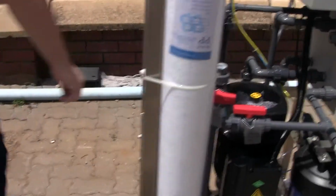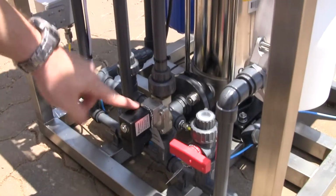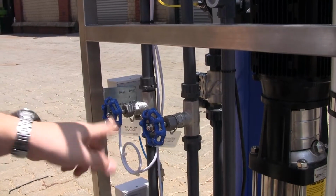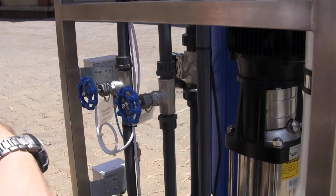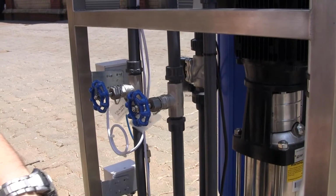And then on the other side we've got the wastewater side. So you'd open this valve, you'd manually close the solenoid, and you would close the recycling valve and the wastewater valve both. Then in effect you've got a completely closed loop system, and you can just circulate the same liquid through and through with the extra pump. And that's how you clean the membranes.